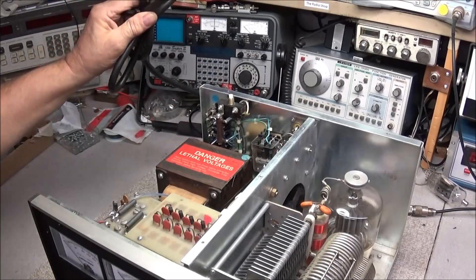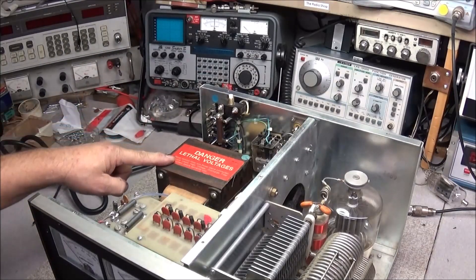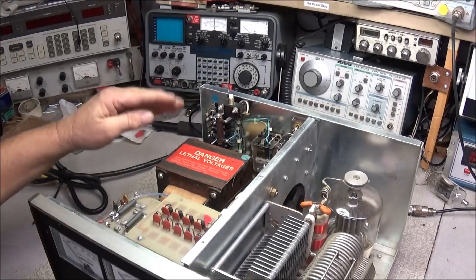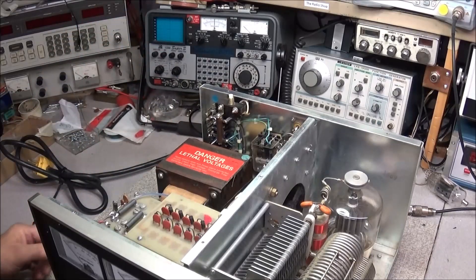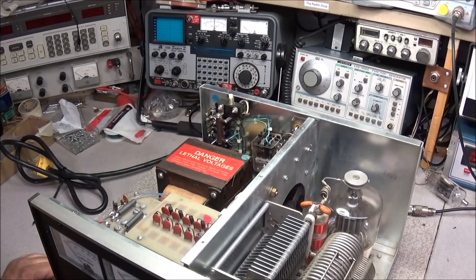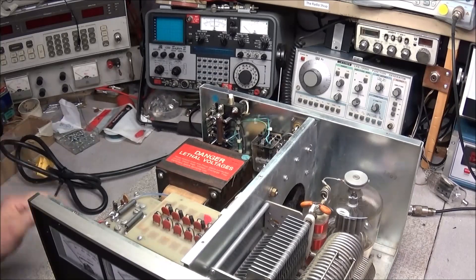That's another reason why you make sure you never have it plugged in. Also on top of the transformer, you see it in big bold letters: danger, lethal voltages. It tells you never remove cover with power mains connected. Always check for high voltage and discharge filter capacitors before servicing. Normally what I do is I have some resistors that I'll clip into the high voltage section and let it drain down. This way we can be sure there's no voltages left, and then test with the voltmeter on the plate of the tube.